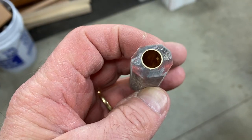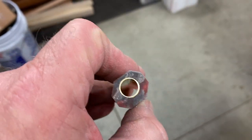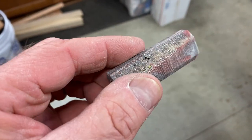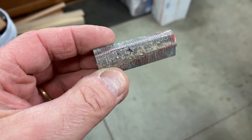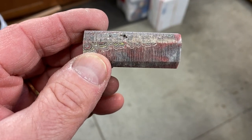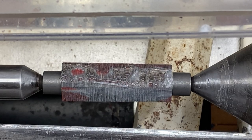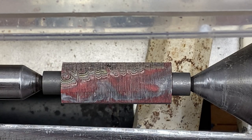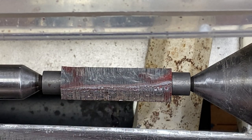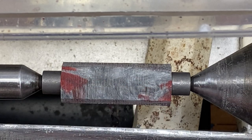On this particular blank I used the corner cutting jig and cut it twice — it was a very large blank to begin with and I wanted to remove as much of that meat as possible. I've got plenty of room there on both ends for my bushings; this should make turning an awful lot easier. There's a little void there we'll work on whenever we get ready to turn. We'll soak this in CA and hopefully be able to keep all those paint chips together. I've got the Fordite and resin blank chucked up. What I was told is that I need to saturate this with CA glue before turning. I can see there's a little bit of a void there, so I'm going to get some cardboard on the lathe and then we're going to run some thin CA glue over this and just let it soak in as much as possible.